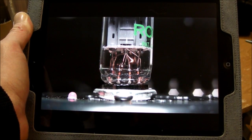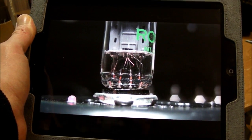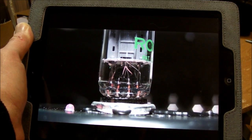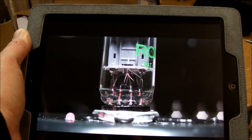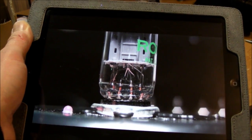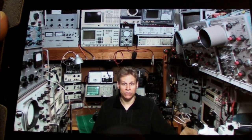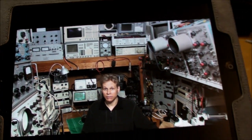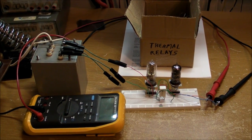There it goes — that's definitely no good. Some tubes will have that problem. He demonstrates two different ways to correct it, and you should definitely check out his channel if you're into vacuum tube or solid-state restoration, reverse engineering, or repair. But let's get on with my third solution for this filament flash problem, which is to use thermal time delay relays like this one right here.